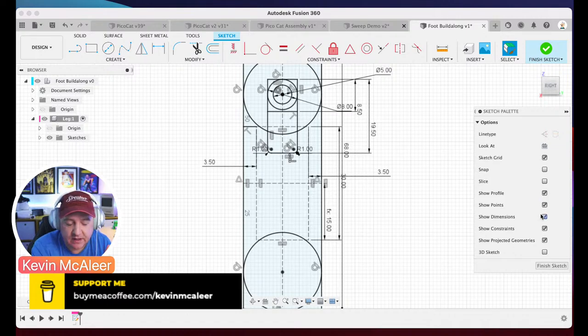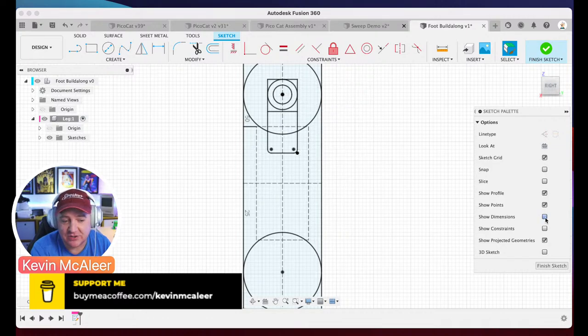Sometimes when you're working, you think, I can't see everything, there's just too much going on. So if I click hide the constraint, you can see all those little symbols disappear. That can be useful if you just want to see the dimensions. Sometimes you don't even want the dimensions, you just want to see the sketch because you're trying to find a particular line. And if you've got any points on there, which are those dots, they usually represent the center of an arc. So they're useful sometimes to show, other times they're just visual noise and you want to get rid of them. And the profile is that sort of light blue